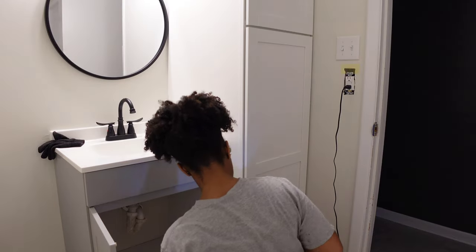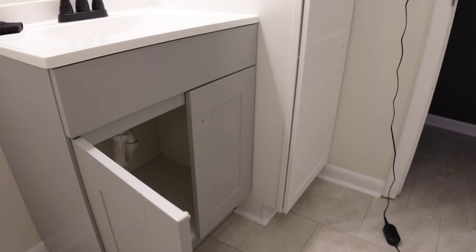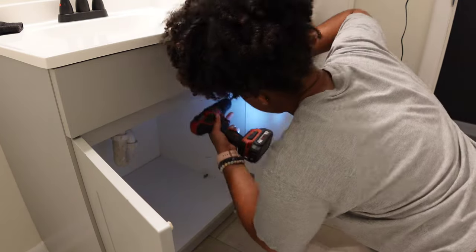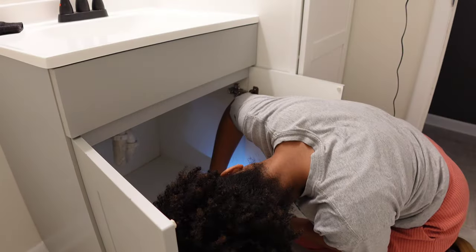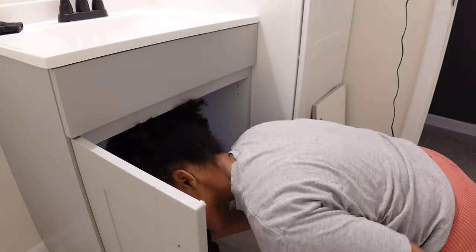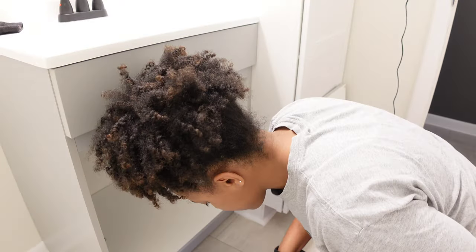Now it's time to move on to the cabinets. I'm taking off all the hardware because, as you can see, I have mismatched cabinets — one's gray and one is white. So I plan on painting them this nice thyme green color. The color is called Dry Thyme by Sherwin-Williams. I'm obsessed with all Sherwin-Williams paints and colors, though this isn't a Sherwin-Williams ad, just my preference. I'm taking off all the doors — these are just held together by some simple screws. You do want to make sure you keep the hinge sets together, so if you have a top set of hinges, make sure you reinstall them on the top and the bottom.